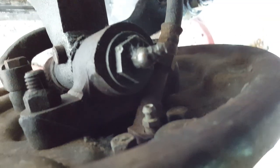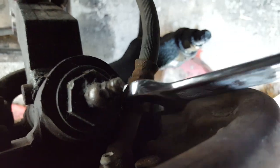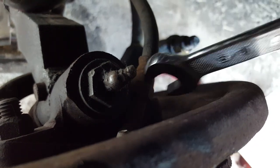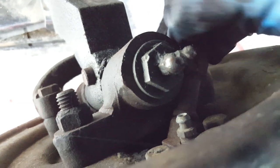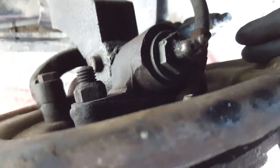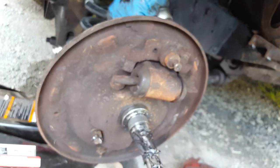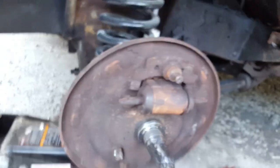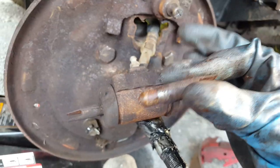I'm gonna take the cylinder out. It's pretty simple — there are two bolts right here and here. Before I do that, this right here is the hose going to it. All I need to do is just crack it while it's still on here. Once you crack it, it moves really easily. This was a 5/8 and then this is a 1/2 inch for these two bolts. Take those completely off — it'll come right out and pull right through.